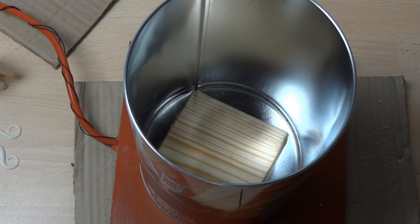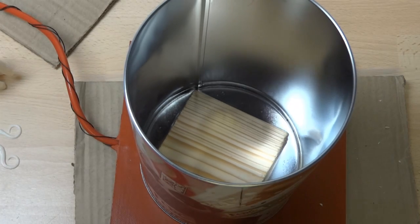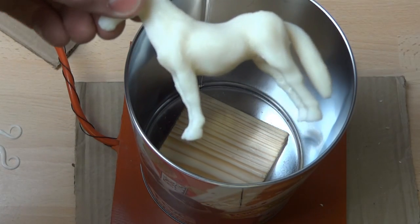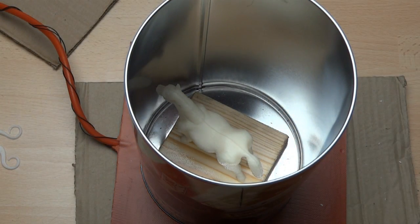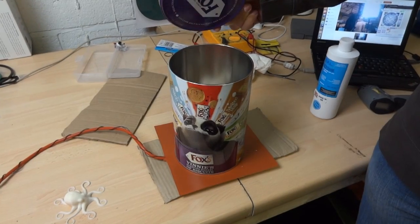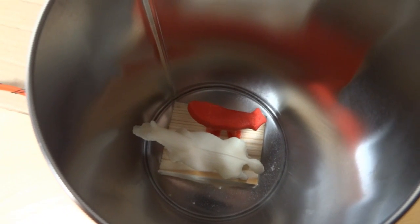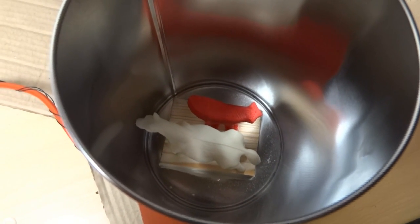So we think we can see a vapour cloud of acetone just above the surface — it's going to be quite hard to film. We've also dried the piece of wood off so there's no acetone on the top surface. Let's place in... shall we try this one? Let's stick the horse in here. It's definitely warm in there. The tail's got some really nice highlights on it that we can watch for in the effect. It's quite a coarse print, a 0.4mm layer height with a half mil nozzle, which is the coarsest my printer would go. So we put a lid on to try and keep the vapour in, although acetone vapour should sink. We also put in another piece — the Superluminal banana. Stuff is happening; the red piece had lots of hairs on which have now melted away.